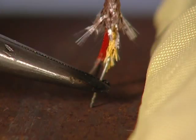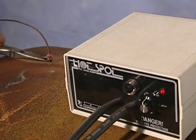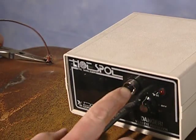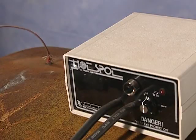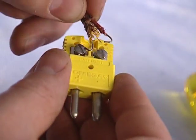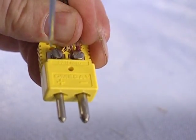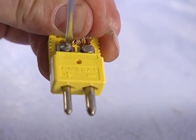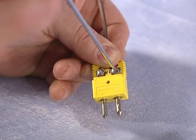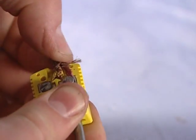Using a monitor thermocouple for control will overheat the material in the heat zone. A Type K 20-gauge solid thermocouple wire, consisting of two wires, will be spot welded directly to the workpiece using a thermocouple attachment unit. The other end is fitted with a two-pin Type K connector. The positive wire is marked as solid yellow or striped yellow. The connector screw terminals are marked positive and negative — be sure to attach the wire with proper polarity.